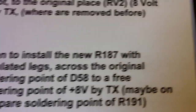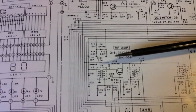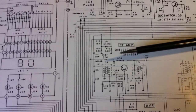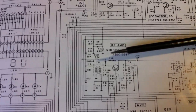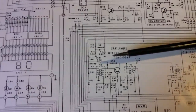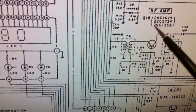We can see here in the diagram: this is the Q18 and the D58. This circuit is not included in all Cybernet radios and in all schematics. I think it's exactly for this transceiver where the CW mode is used — it's for break-in operation. You can see on another diagram as well; the circuit is not included there either, but it's the same circuit.